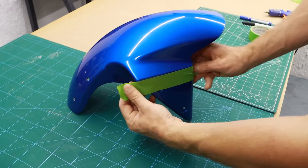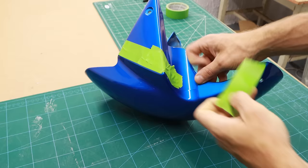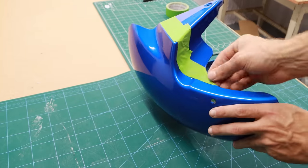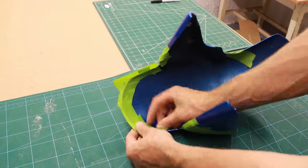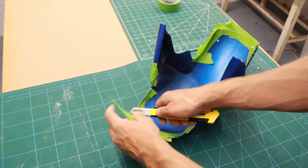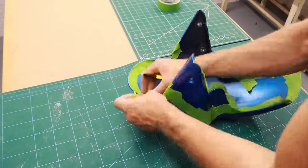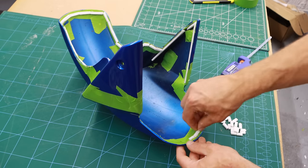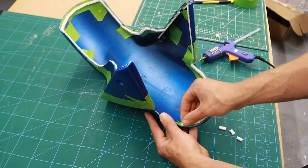I will start with making the barriers. I am using masking tape to make the lines around the fender for the barrier. It's going to be a three-piece mold. If you look at an ABS plastic part you can see a split line where the factory had their mold split originally, and this can give you a guideline whenever you are making a mold of the part. These little pieces of fluted sign boards give me extra support for the flanges which will overhang the size of the pattern.